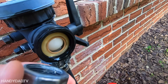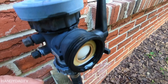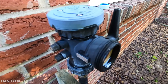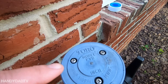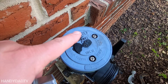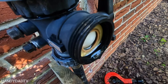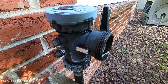In there is the ball valve that this seats up against, and the other one down here is obviously leaking as you can tell. I've got excess water there. I looked online to see if this is model PVB — it's a Toro — to find a rebuild kit, but I couldn't find one. It's about $60 for a new valve. If anybody knows of a rebuild kit for this, let me know.